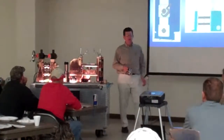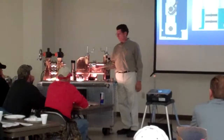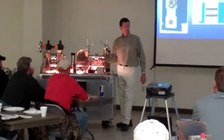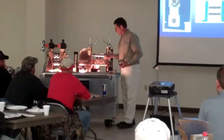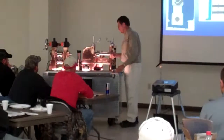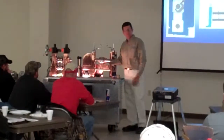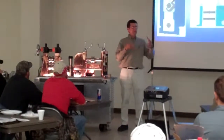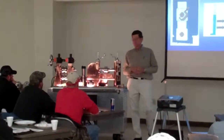Most of us change our tooling by doing what? Sliding it on and off. So if I've got an undersized shaft, how is my tooling going to fit? If I put my spacer on here, tooling, spacer, put my outboard stand on here, lock it down, and I've got this position — how is that roll going to ride? It's going to lope, isn't it? So what's the lightest gauge we run in the audience here? What's the lightest decimal?